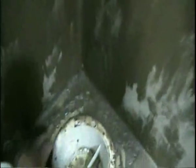Now that the concrete render has been completely covered with the G4, it should take between 60 to 90 minutes to dry, depending on the humidity of the working area. Check the G4 until it dries to a tacky finish. The resin and fibreglass should be applied no longer than four hours after this point.